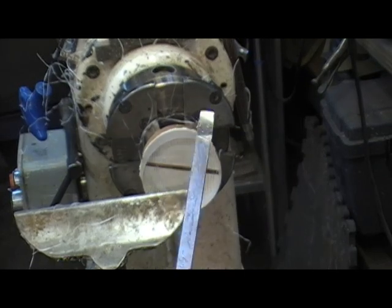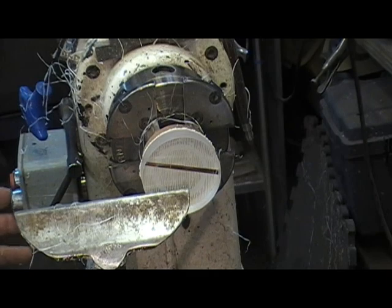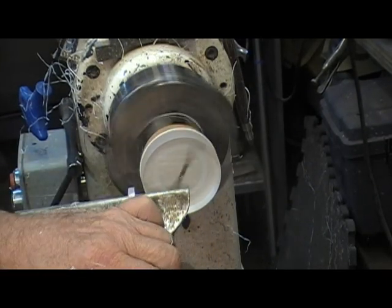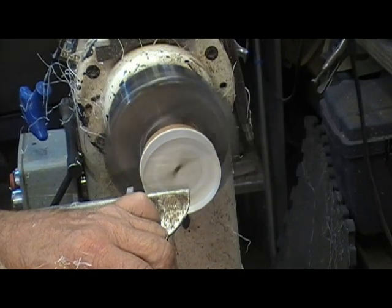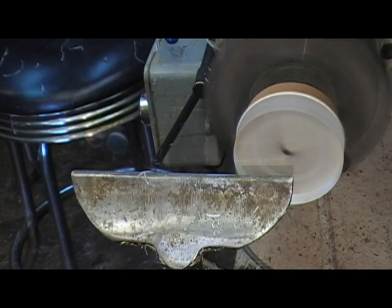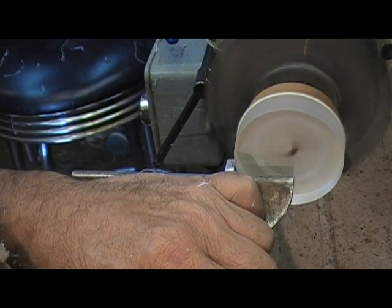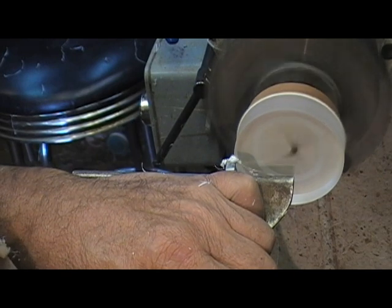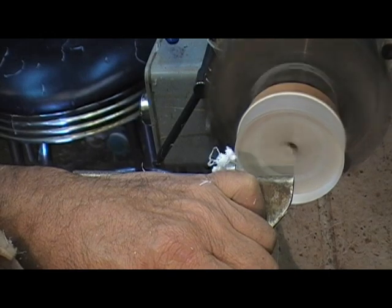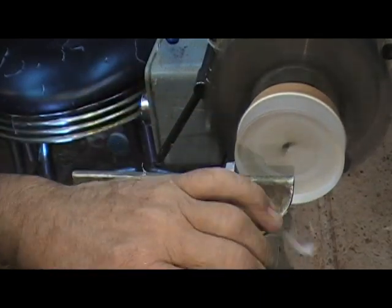And to do that, I'm going to use this little 5/16 inch detail tool. And I'm going to stay at the main speed, and I'm going to move you so you get a better look. We are back at the increased speed of 2,000 RPMs. You see that? We're going to take a little bitty bite. See how it knots up? That's when it's melting off or scraping off.